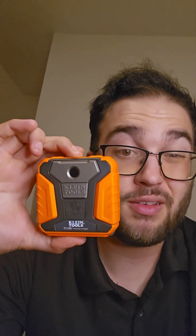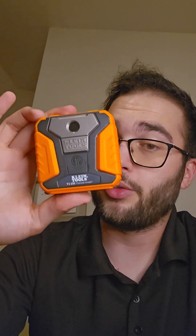Why did I buy this? This tool was $300, so it was a pretty hefty buy. But I bought it because I think it can provide me a lot of information on some of the jobs I go out and do, and I definitely think it can earn me more than that $300 price tag. My plan is to use this to scan panels, see if there are any overwhelmingly hot spots, during a panel inspection — which I charge about $150 for. I'd take this, scan the whole thing, see if there are any hot spots or breakers on the brink of failure, or any hot spots in the wall with the electrical wires. I definitely think it's a good buy.